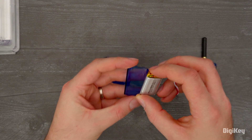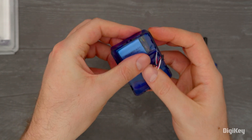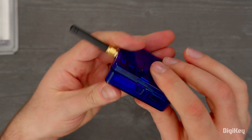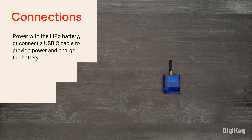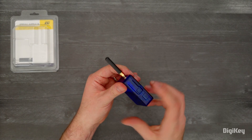Install the battery and cover inside the empty half of the enclosure. Connect the battery to the Astro 1B boards and snap the case together. You can run the kit using the LiPo battery or plug in a USB-C cable to power the kit and charge the battery. Turn it on by pressing the side button if it doesn't turn on automatically.